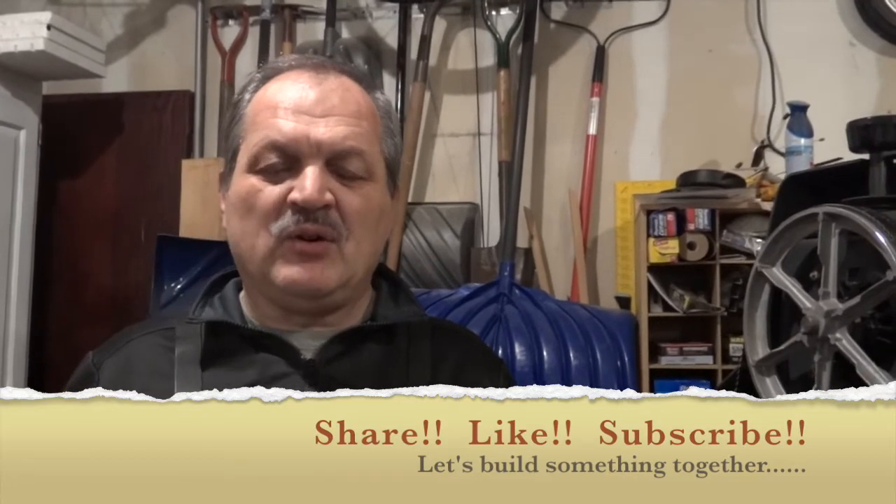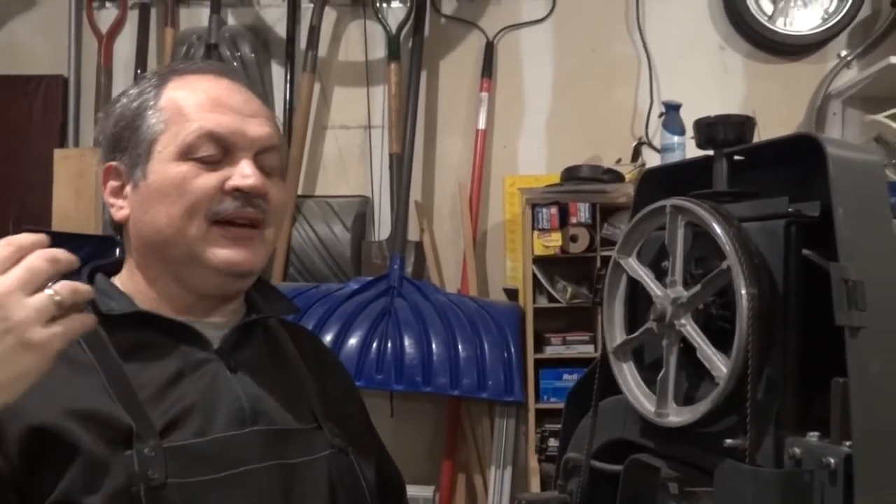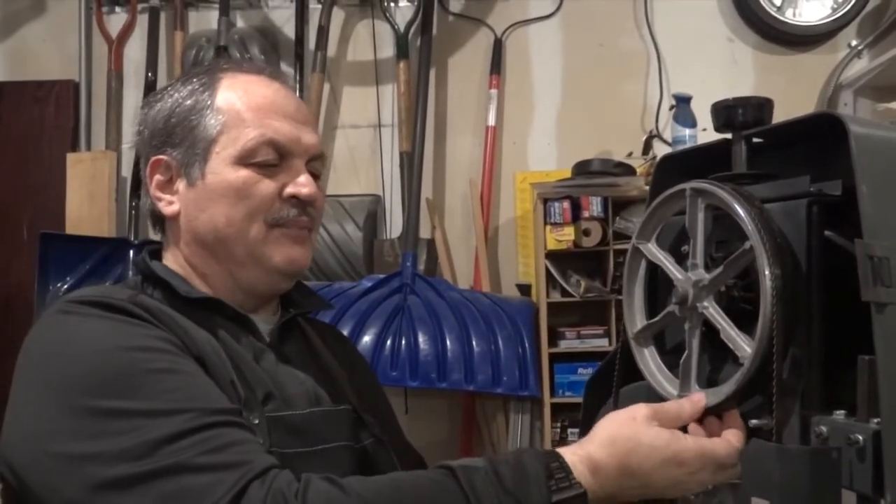Like, share, and subscribe so we can continue generating content for you. I want to mention: if you have a saw and the tire moves — on this specific saw it will fly completely off — the problem is not the tracking mechanism, which I initially thought was the issue. We spent hours trying to fix the tracking, but that was not it. It is actually that the tire has become too loose, too stretched, and you need a new tire. We are going to see you Sunday with a build from the Grass Woodworker. Have a great week!